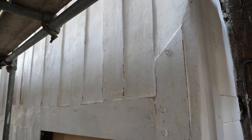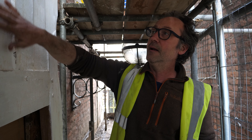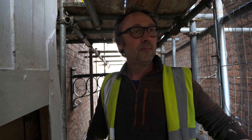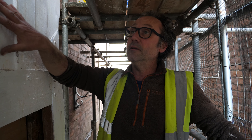We let that dry off a bit and iron it all in, and then when it's still a little bit damp, paint it with the lime wash straight away — that way we have no cracking and everything is setting off really nice and gentle. Underneath all of this we found it was a stone dust and lime mixture with hair in it as the top render coat.